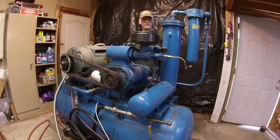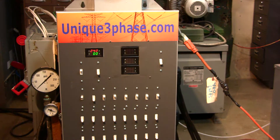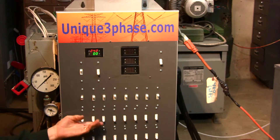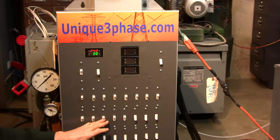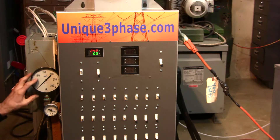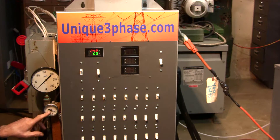We're going to start it up and I have another camera on my test box so you can see what I go through starting something like this. First of all, you can't start this compressor 20 times in an hour — it's a huge power surge. The compressor and motor manufacturers say you can start the motor about six times an hour; after that you're overheating it. I had my capacitors ready — I put in the top row and most of the next row. I've got an air pressure gauge here and also a vacuum gauge, but it's measuring capacity.